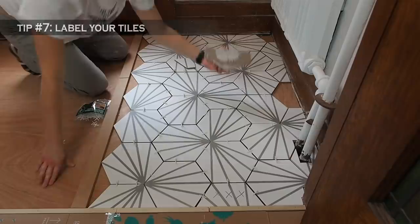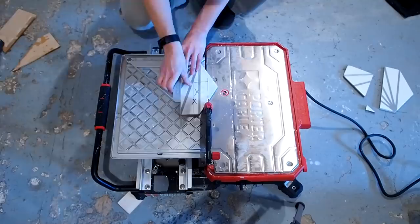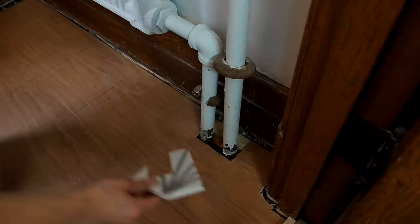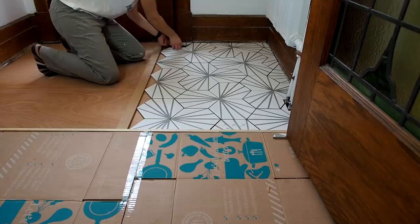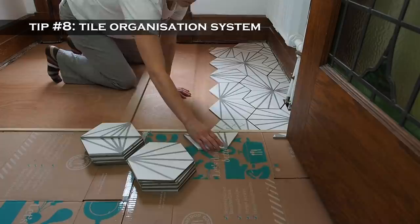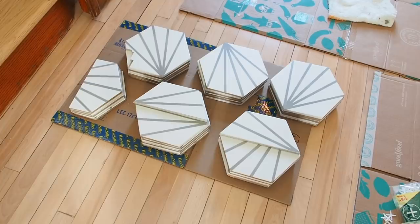With all my pieces cut and fitted, I'm now ready to start actually laying down tile. If you're wondering how I cut that weird little piece around the radiator pipes — pliers didn't work, but a little tap and the piece broke off clean. Getting this fit just right was so satisfying. I started removing the tiles from the dry layout but needed to be really deliberate about it to avoid messing up the pattern. Tip number eight: when working with patterns, it helps to make one pile per row, maintaining the orientation of the tiles as well, so you can just grab them without thinking during installation.